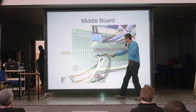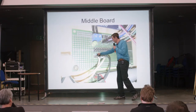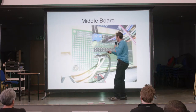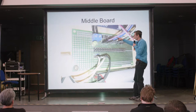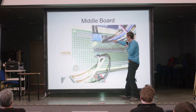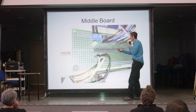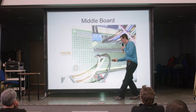In comes your Pi header. There's your three pin-outs for your thermosensors — they need a 4k7 resistor, so I put that on the board, though it didn't work out so well; turns out I did a couple of bits wrong. This is your five volt out, which runs the relay board, because that needs a five volt power supply and the Pi will give it one. Then you've got all your connectors out to the relay, and there's your diodes out to your common rail, which then switches for the boiler itself. So anytime you bring these live, your diodes come out, bring live the common rail, which switches your boiler.